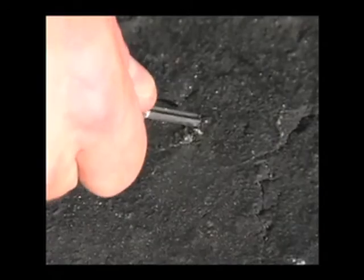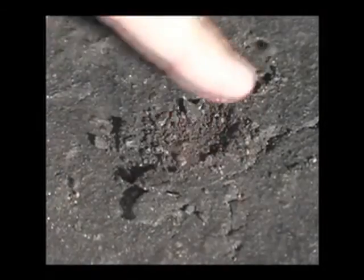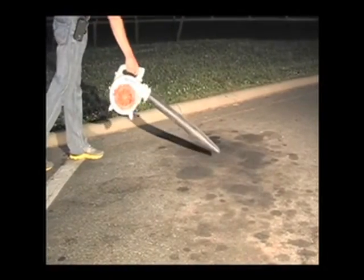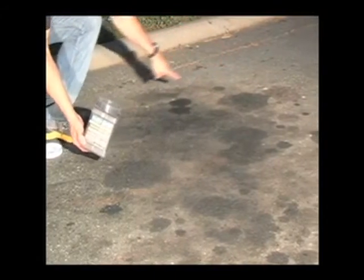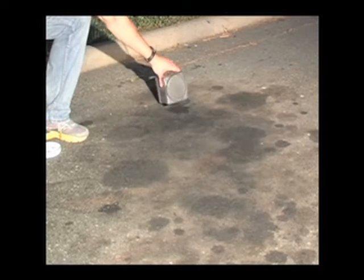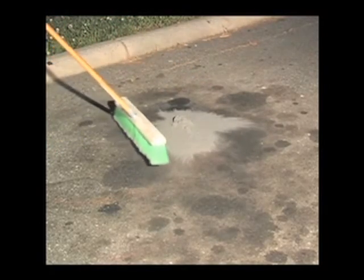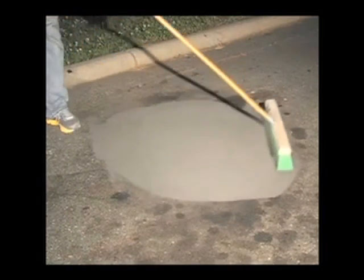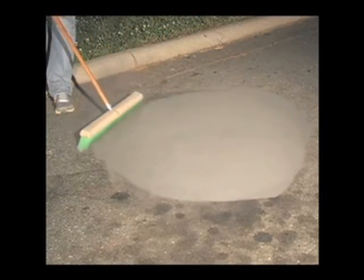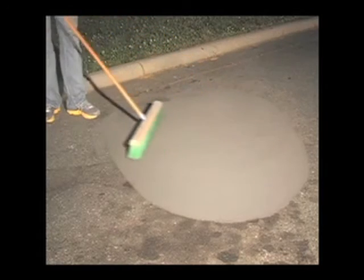For asphalt stains — asphalt is made of a hydrocarbon material already, so the oils break it up very easily. Our asphalt conditioner actually conditions the asphalt to preserve the life of it, as well as make it look very appealing. Again, blow out the area. In the case of asphalt, we're going to treat only the asphalt stain. Put a pillow of material on top of only the asphalt stain, because this material is very dark and very dusty. Look at the difference that it makes once it gets broomed into this surface. If the oils bleed through the asphalt conditioner, keep working it into the stain until they are completely saturated. A circular motion is best for this asphalt application. Look at the difference that makes.